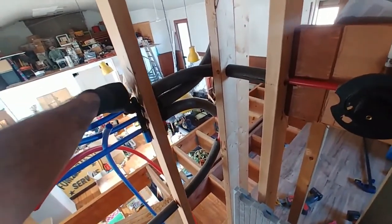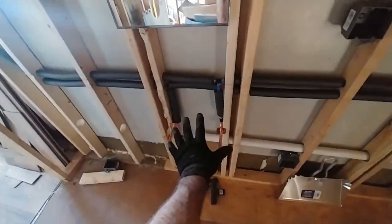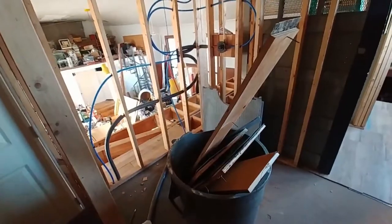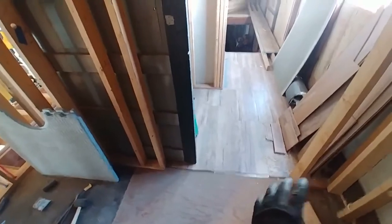have only got one connection at the manifold where the mains come into these hot and cold, or you know, at the other end where this goes to the mix valve, and over here, you know, there is a T because we got two sinks, so there's a T on the cold and a T on the hot at this particular sink station. But other than that, the only other connections are at this end here. And we had other considerations here, given the finished nature downstairs, that kept me from bringing this over underneath the floor, coming through the wall. Obviously there's a door, so we opted to go up above and do a spin here.